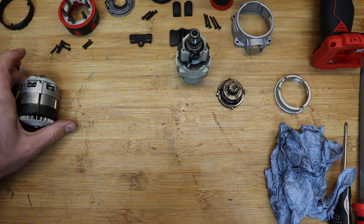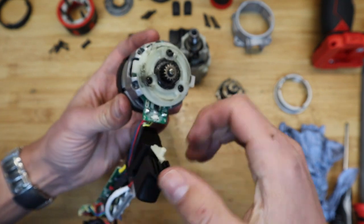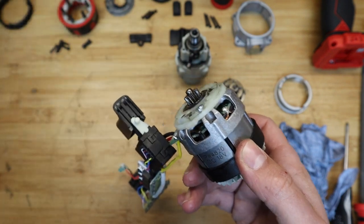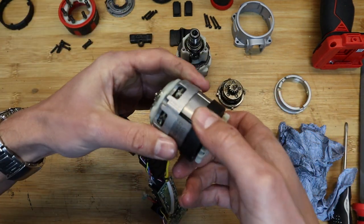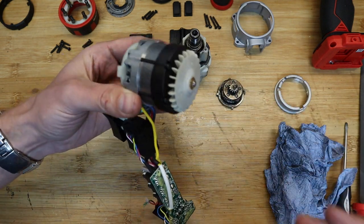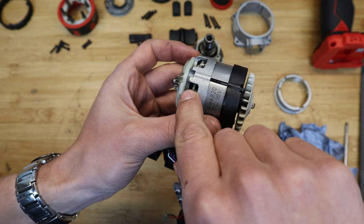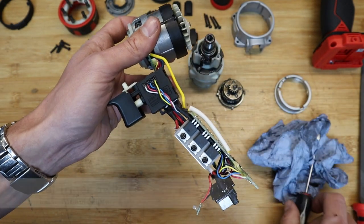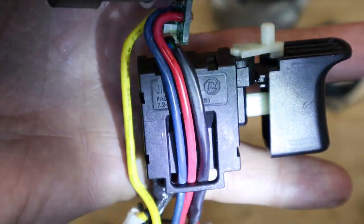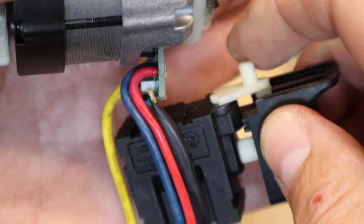Now let's look at the electrical parts. There's a small brushless motor control board, very similar visually to the one in the impact driver. It wouldn't surprise me at all if the internals are pretty much identical — if you've developed a brushless motor, you try to implement it in as many tools as possible. The switch is made by exactly the same supplier as in the impact driver; you can just about see the J-level switch logo — nice solid switches with directional location.